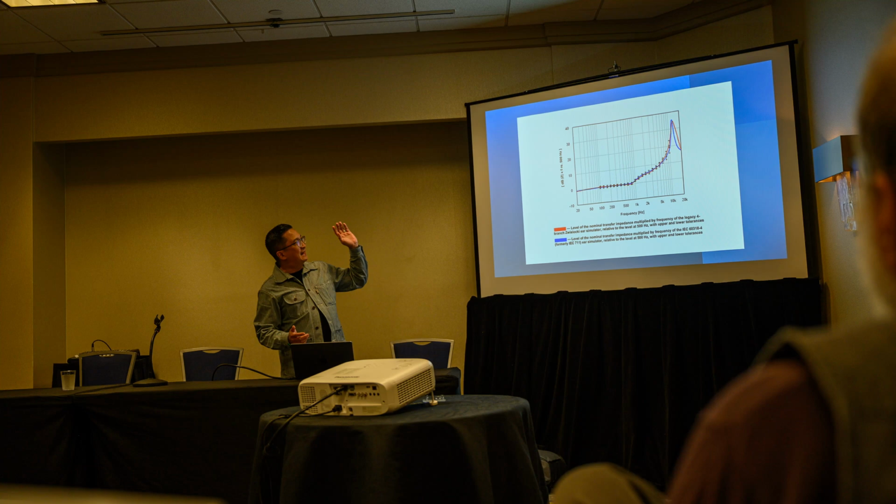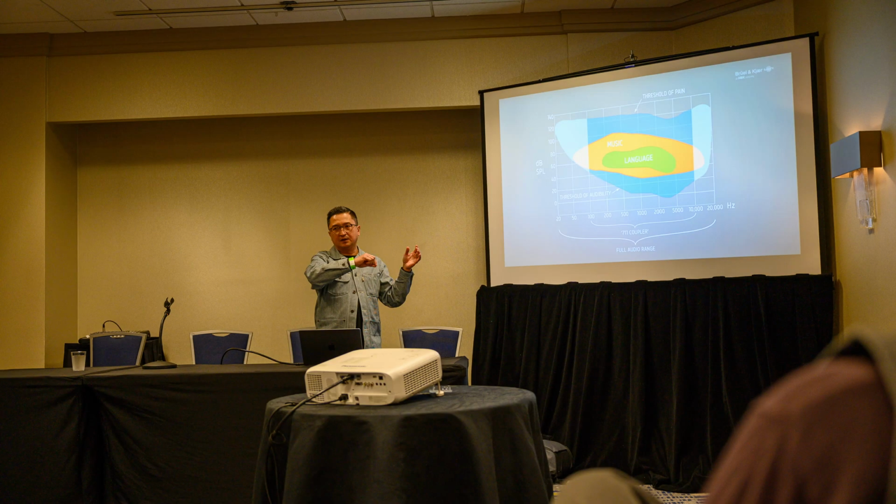But when we get to the standard itself, I'm not sure how they got the range. Generally speaking, when you talk to people who worked on it years ago, they consider the upward operational range to be about 8 kilohertz, not 10. But the standard shows 100 to 10 kilohertz. So 711 covers that range where it's bracketed, but that's only if you measure at the reference plane, which we'll get to in a minute. If you go further away from it, it can narrow the measurement bandwidth.